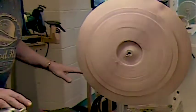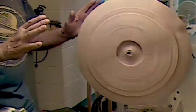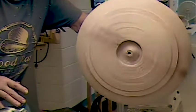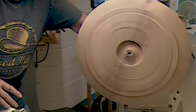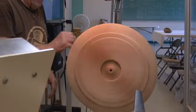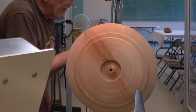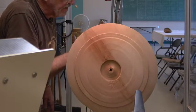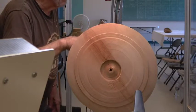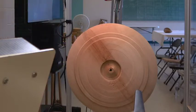So we were successful in making this thing turn around and run absolutely perfect. Sometimes there's a 64th or a 32nd that you can't tolerate. You just can't. Masking tape is 2/1000ths of an inch thick. You put 2/1000ths of an inch between the chuck and the face of the spindle where it registers, and it'll move this surface here a 64th.